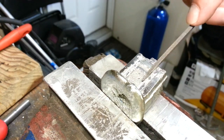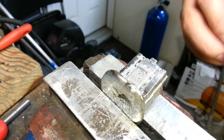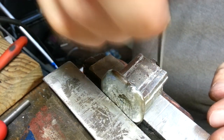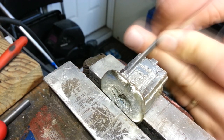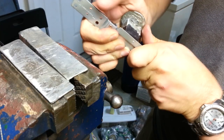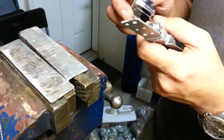Just need to cut these grooves a little deeper. There's a groove here and a groove here that has a companion part on the other side — we need to get these a little bit better defined before the part will fit. Check our fit — we're still off somewhere. Something in there is no good. We're going to see if we can identify the high spots. We're going to Sharpie the possible high spots and watch for the Sharpie to rub off when we try to mate them together. It's pretty good — that's certainly close enough. It smashes in there to size, which is perfect. It has a few worn spots — we'll file those down and then we'll call it good.